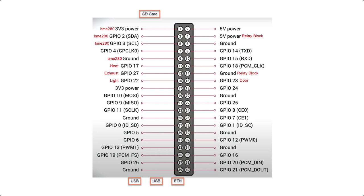Please take your time and make sure you have all the wiring terminated correctly before you power up the Raspberry Pi. I urge you to check, double-check, triple-check your connections. It's so easy to make a mistake connecting to the wrong GPIO pins. One minor goof can burn up your Raspberry Pi — it shorts something out in the transistors and the GPIO can't be used anymore. However, you can't go wrong if you follow everything that's on this diagram. It works.